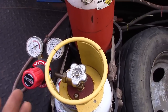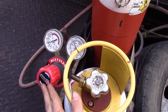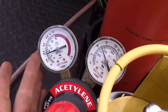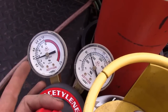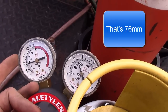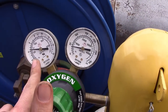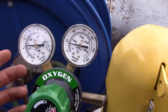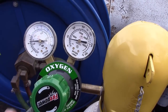I'm going to show you what you need to set your acetylene and oxygen regulators on. Generally, most of the time, I have my acetylene set on five PSI. You can cut a lot of thickness with only five PSI — you can cut up to three inches thick with only five PSI, so don't think you need a lot of acetylene gas. Your big metal movement comes from your oxygen, which I normally have set on sixty PSI. That's a rule known as the five-sixty rule.